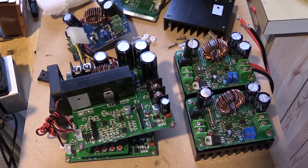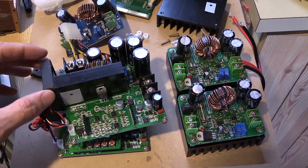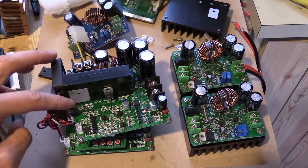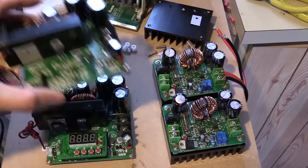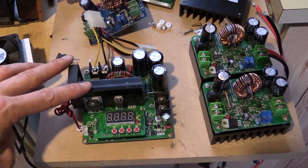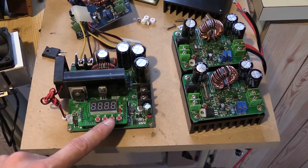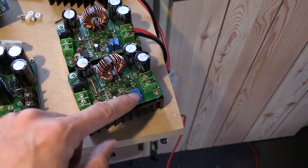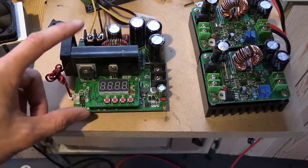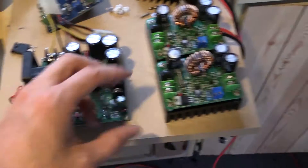That's a bit of a pain because it would help me identify exactly at what point this thing blew up. But either way, the only thing that seems broken on the board is the power MOSFET. I've ordered another one — hopefully here in a few weeks. In the meantime I've got this new unit and I've tested it — it works fine. I'd like to use this because it's 900 watts and I really like the digital display and digital settings so I can be very precise, rather than using these turn pots.